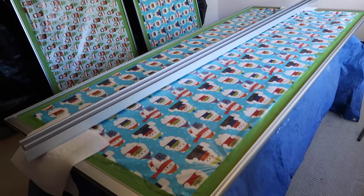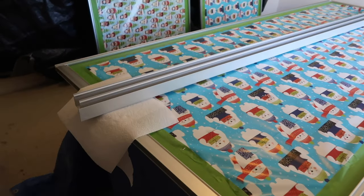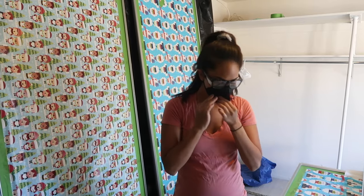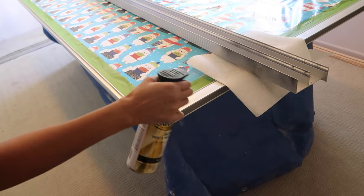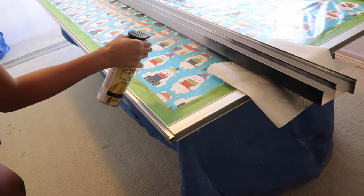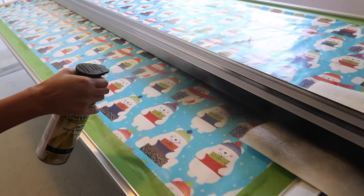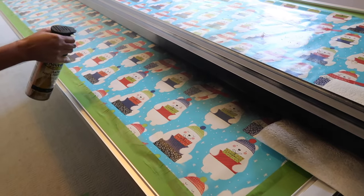It's finally time to start spray painting. First, put on your safety goggles, then a mask or respirator. I'm using Rust-Oleum satin all-in-one spray paint — I love it because it goes on really smooth. For your first coat, go in slow back and forth motions, but you don't have to get full coverage because you are going to do another coat.